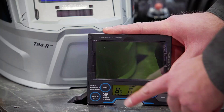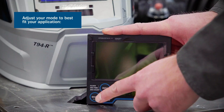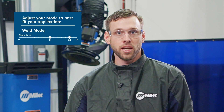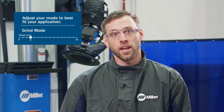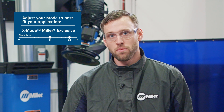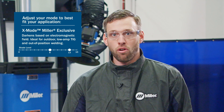Now let's walk through a few of the controls on the helmet lens. This lens features auto-on and auto-off, along with a grind mode and low battery light. The mode selection allows you to adjust between weld, which gives you shade control from 8 to 13 in half shade increments; cut, which changes from shades 5 to 7; grind, which is set at a light state of 3; and X mode, which also adjusts between shades 8 and 13, just like weld mode. X mode, though, darkens based on the arc's electromagnetic field, not the brightness. It's ideal in outdoor and low-amp TIG applications or for out-of-position welds. Nearby welding may affect X mode if they're within a 12-foot radius.